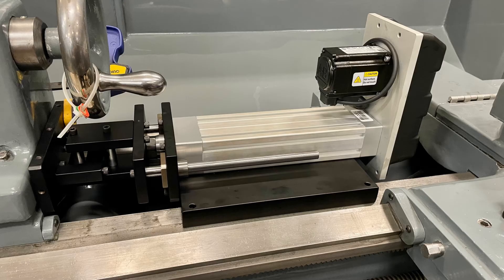This is the driving mechanism for the tailstock. The linear actuator advances the tailstock forward to initiate threading and pulls back on the tailstock to release the die head at the desired thread length. Guide rods and linear bearings were added to protect the linear actuator against external moments.